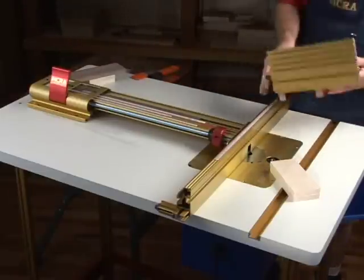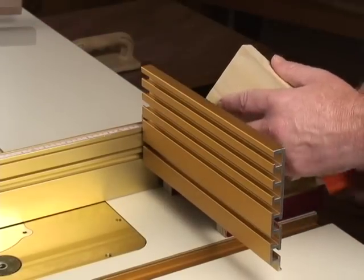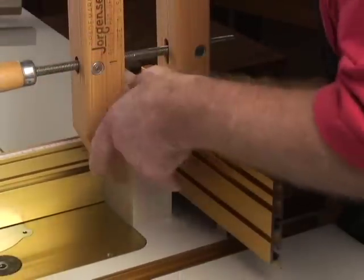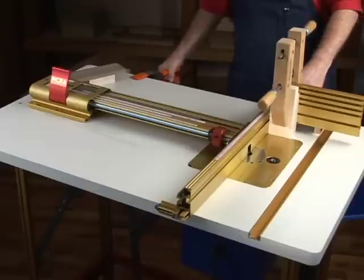Clamp the right angle fixture to your fence and table, then clamp your two long pieces with a backing board to the faceplate using a wooden hand screw clamp. You can use your centering board as the backing board. Remove the spring clamp.